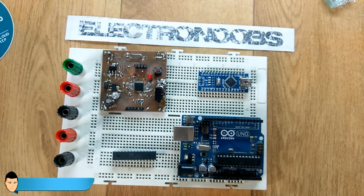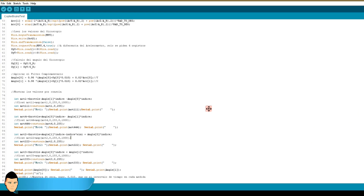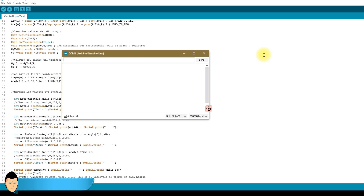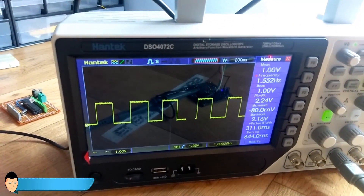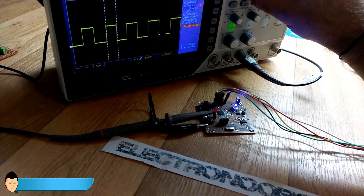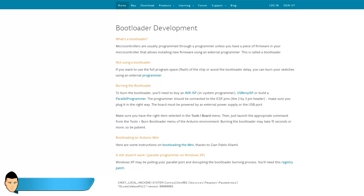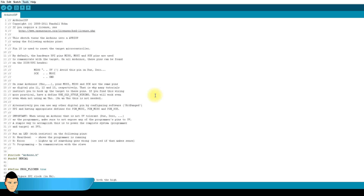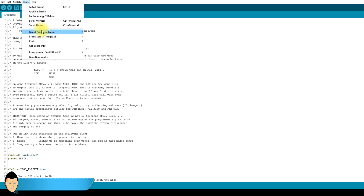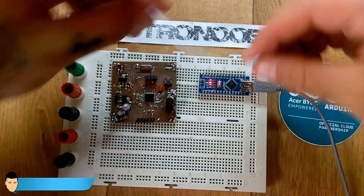After uploading code to my Arduino Uno bootloader-burned chip, I saw that it was processing very slowly — even with a 250,000 baud serial connection the serial was printing one row per second. I even had problems with a blink code, the frequency wasn't what I expected, and the I2C connection was also broken. So I decided to re-burn another bootloader. I searched for a special bootloader for the AU chip, tried selecting other boards, but using the Arduino Uno as ISP would always burn the Arduino Uno bootloader.